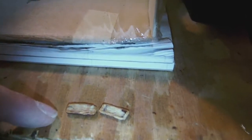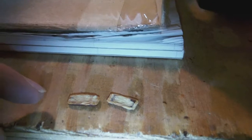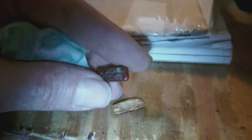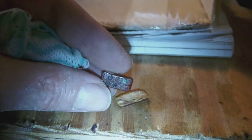So even if there are only some traces of alcohol left in the body of the capacitor's shell, it would probably be enough to corrode, as it were, or to make the hot glue loosen up or weaken sufficiently that it would fall apart, something we don't want, of course. Then, of course, I could use acetone, but acetone has a very nasty property to be able to dissolve ink and/or paint, and that we don't want either. Yeah, we want to preserve the coloring on the capacitor.